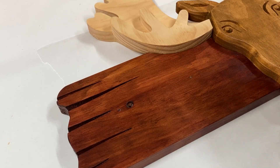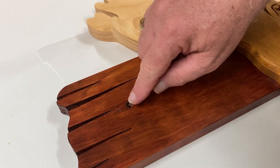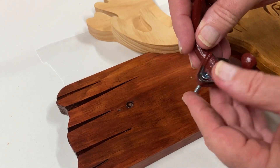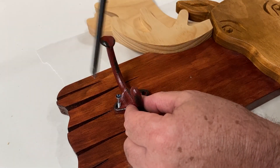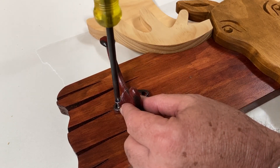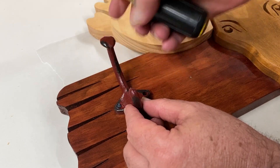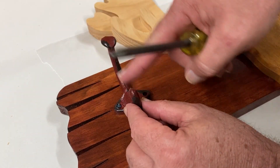We're on the home stretch — just got to mount these coat hooks. Here's one of the mounting holes, the countersunk hole for the wall mount into 16-inch center studs, and I've got the left-hand hole pre-drilled. That covers up the mounting hole, so you put this on before or after you mount it on the wall. I'll just put one screw in so I can adjust it side to side, and then I'll make the pilot hole for the other screw, just to make sure this is going straight up and down.